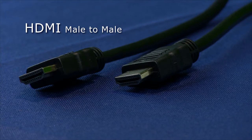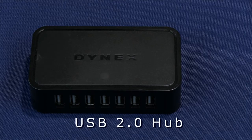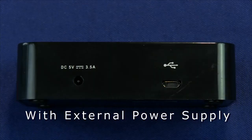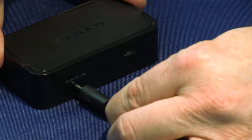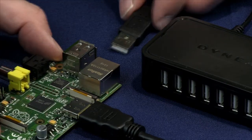For a video display, use an HD monitor and a standard HDMI male-to-male cable. To avoid power-related problems, we recommend using a USB 2.0 high-speed hub with an included external power supply. The hub's external power supply will prevent extra burden being placed on the Raspberry Pi.